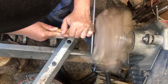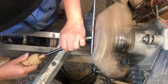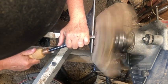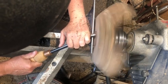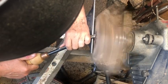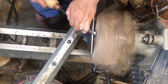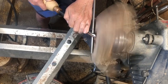Just starting to cut my recess here — I wanted to go ahead and take care of that. The wood is solid there, so I used a small parting tool to cut the initial circle, giving me a place to cut my recess to. Went back to my bowl gouge, and I'm just taking from the center out to the outer edge of that recess. I'll make a pass or two there, then take a pass from the outside in just to clean it up and have a nice smooth surface on the inside of that recess.